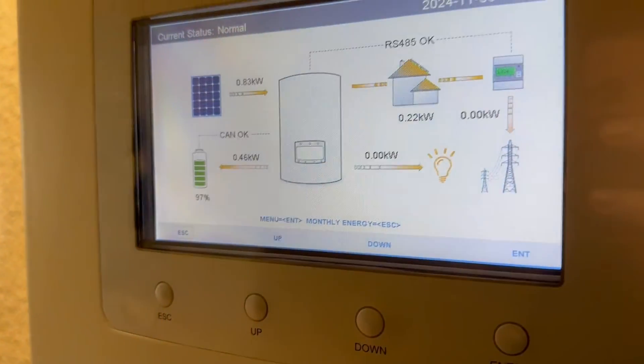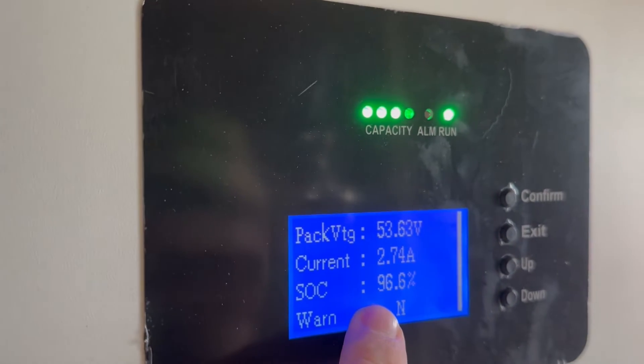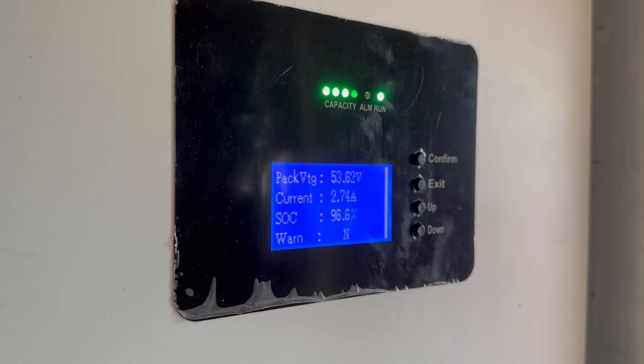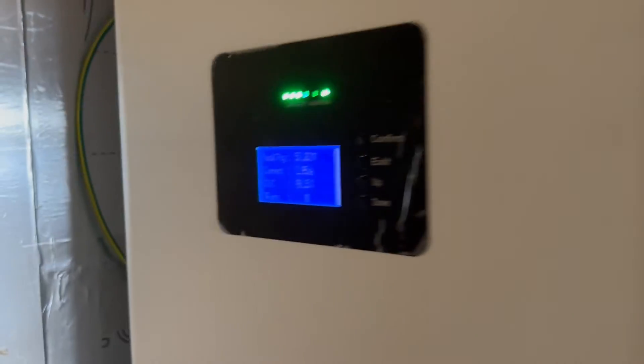Final day of this bus bar project. Just home from work early — it'll be busy from tomorrow, so just as well this is the last day. I gave the batteries a full charge last night from midnight; the charge window was midnight to 6 AM, so they got to 100%. Inverter is now showing 97%. Battery one is at 98.5%, drawing just below 3 amps; battery two is drawing just at 3 amps at 98.5%; battery three is at 96.6%, drawing 2.75 amps. It looks like battery three still has a little bit of balancing to do.